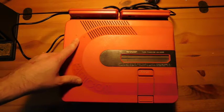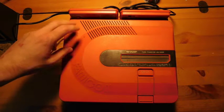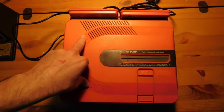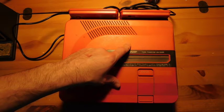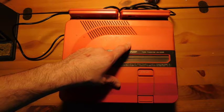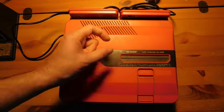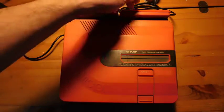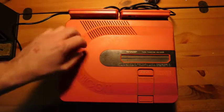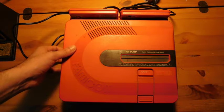What's really nice about this unit is that it allows you to play regular Famicom games, and it also has a floppy disk port for Famicom Disk System games. A lot of people don't know that all-time classics like The Legend of Zelda and Metroid first released as Disk System versions. It also has composite video output in addition to RF, all in a single package. Today we're going to improve the video quality significantly with an RGB mod, which taps into the picture processing unit chip and outputs RGB, then converts that to component video.